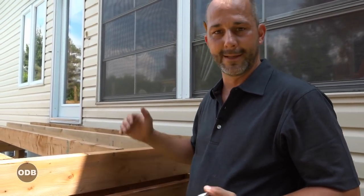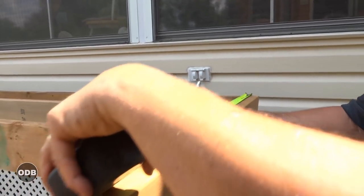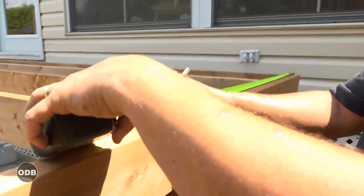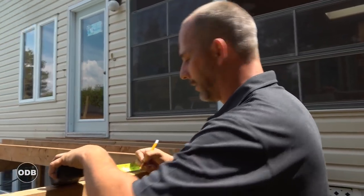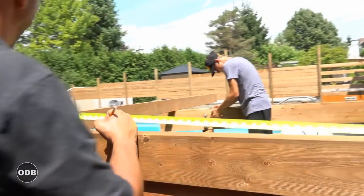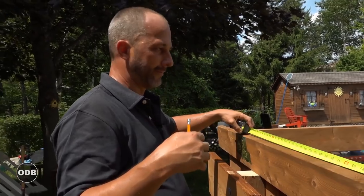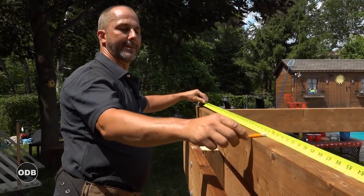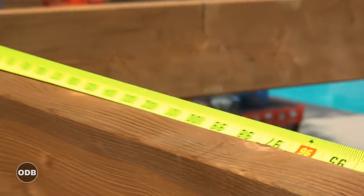All of these joists will be sitting on one of these 2x10s, so that'll transfer the load really well. All I've got to do is mark the outside of my 16-inch on center and put an X where the wood is attached — that represents the outside of the board. In decking, it's not as important to be dead on the money with this because of the way we attach our deck boards. Since we're using the CAMO system, you can't even see the screws. If you're having visible screws, you really want to be meticulous, because with surface screws, part of the aesthetics of the deck is to have them all lined up perfectly — you almost want a chalk line or straight edge. My tape has these little red squares on it, brilliant for framing because that red square is every 16 inches. I don't have to do any math — I just look for the red square and mark it.